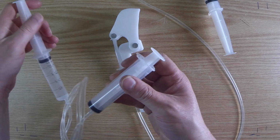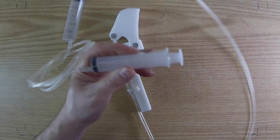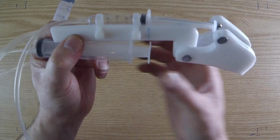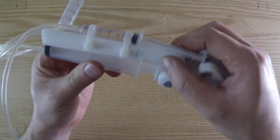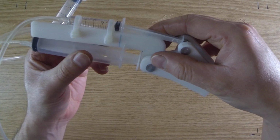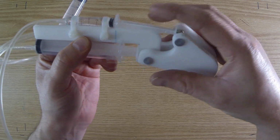At this point we are pretty much done with the body rotate mechanism, so set it aside for now and finish off the neck retract mech. This is the simplest part of the build and requires nothing more than a dab of glue to finish it off. Gather up the L bracket and head assembly and the pair of large syringes. Feed the L bracket into the slot that we cut and check for a good sliding fit. Sand away more of the slot if things are too tight.